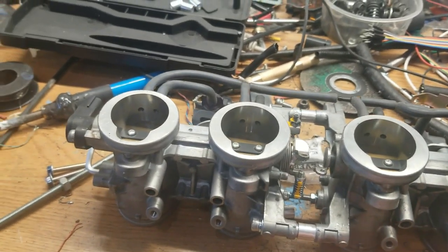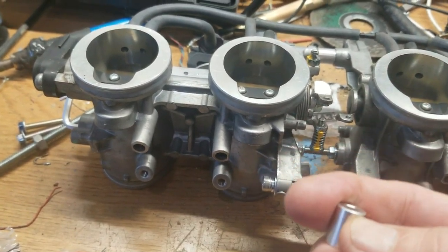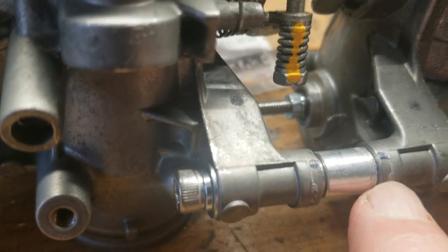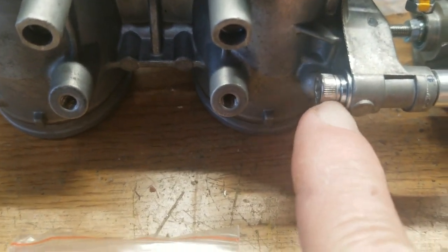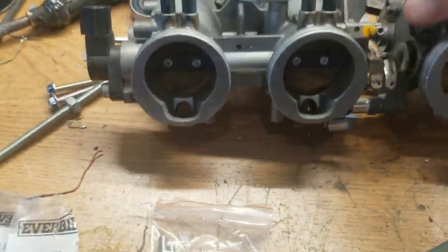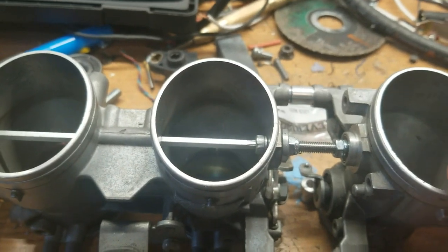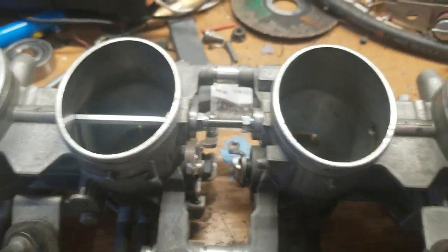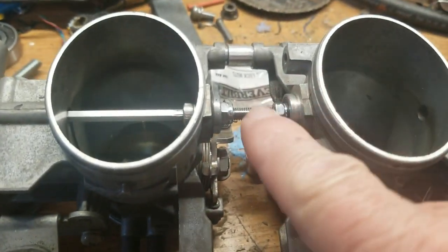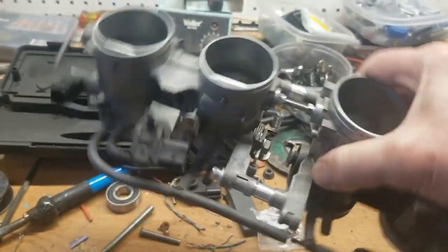I've got the two halves put back together using spacers that are 13mm or 12.5mm. I tapered down one end to fit inside so that it doesn't wobble around. I used an M5 screw, 45mm long, with a lock washer and a regular washer on the end. On the other side I did it at three points. There's really nothing to bite into up here, so I threaded through here, put two nuts on, got it close to right, put another nut in, torqued that down, and snugged both ends up. Now I've got three points of contact to hold these, and they're solid as a rock.